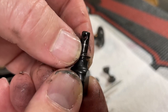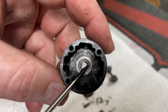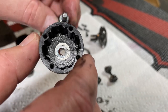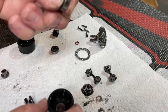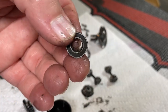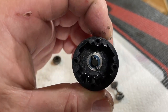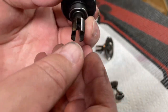When you pull this apart normally you'll have your little orange washer down inside with a metal washer over top. I also found a barely used out-drive cup which looks a lot better than the old one — you can see the comparison and how widened out the old one was. Be careful with out-drive cups: there is a little washer shim on there — don't lose that and make sure it goes back on your new one. Get your orange washer back down in the little slot, then get your metal washer shim on top of that, then slide your drive cup back up inside with the washer. Also make sure your bearings spin nicely and freely with no play — these ones feel nice and smooth.